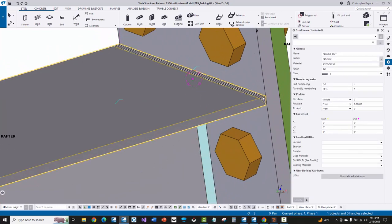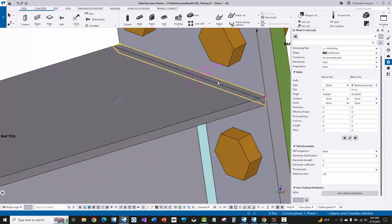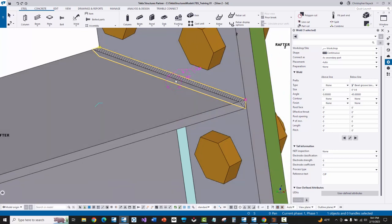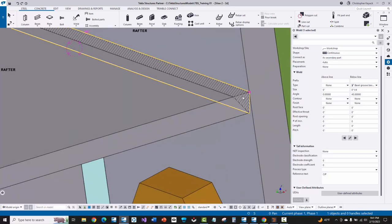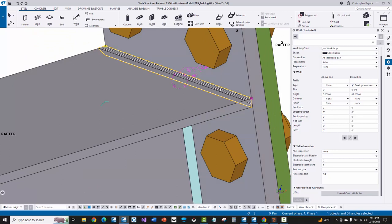Up at the top, I've done something very specific. Here I've put in a proper complete joint penetration or complete penetration groove weld. MBS will not import the weld completely like this, and I have not turned the prep on on purpose — I want to show you what happens in AGT. If you do prep the secondary part, then AGT will ignore this weld because there's a gap there and it can't put that weld on that surface.